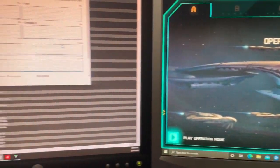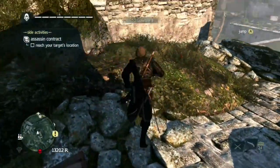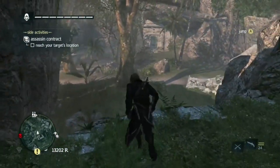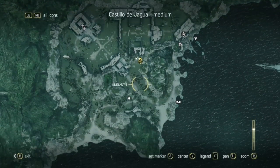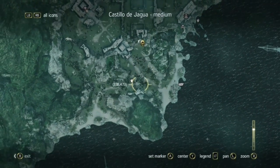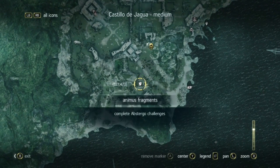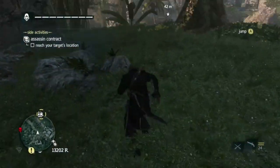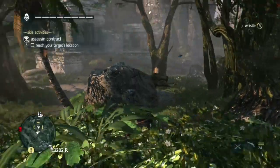The driver install went through no problem. I'm pretty OCD about temperature and I like to have it running really cool so it lasts. I applied the same fan curve I use on my GTX 480, and it barely broke 150 degrees Fahrenheit. While editing this video, I played Starcraft 2, Starcraft 1, and a couple other games to really see if the card is completely stable. I tried to stress clock speeds and similar metrics — the card was 100% stable the whole time, which is really great because I was very skeptical going into this fix.